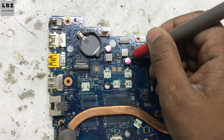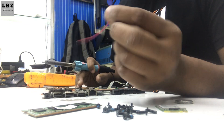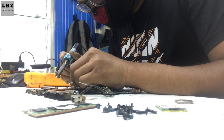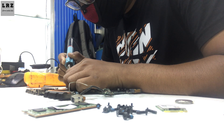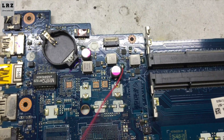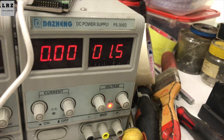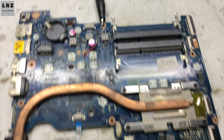Okay, this line is fully short. So now I will find out which part is short. I joined a little wire to this 3 volt line to find out which component is short. This is a very easy way to find a shorted component on the motherboard. Now I will inject voltage on this line, starting from 1.5 volt then increasing to 3 volt.